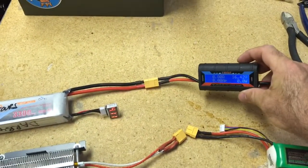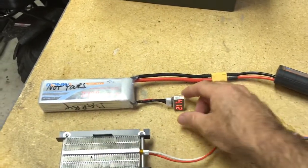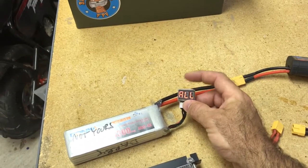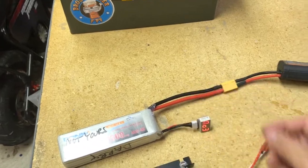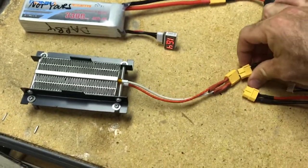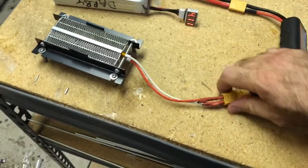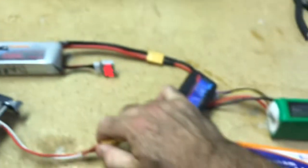What I'll do is hook this up with a watt meter — you don't need that, that's just for fun. You can go straight to the heater. Give yourself a voltage alarm; I can't find mine right now, but set it to say 3.7 volts per cell to buzz you when it reaches that. Then plug it in and watch what happens.